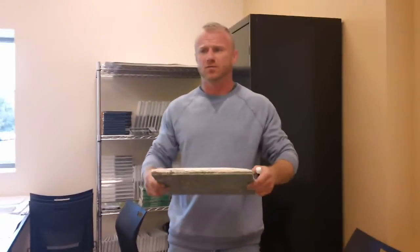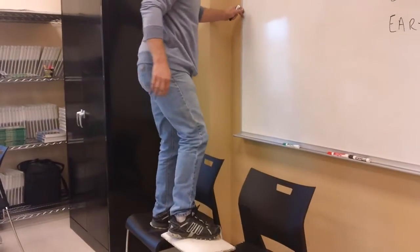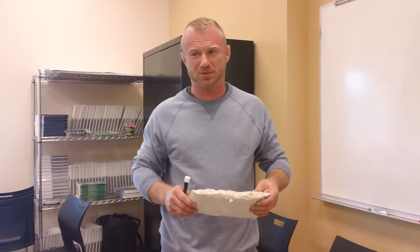There's another piece over here. I also thought this could be built as a tilt-up panel, like a 4 by 8 sheet. That piece right there is 14 inches wide by 12 inches. I'm going to put my weight in the center. And it just did break. I'd say that took well over 100 pounds, and that time I stood on one foot. Wire mesh could be added into this — a thin-gauge wire mesh added over the top of the carpet, or embedded in the carpet, or in between layers would make it even stronger. This could be done with earth plaster too, or with used carpet, wire mesh, and earth plaster.